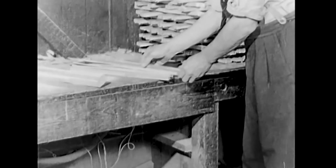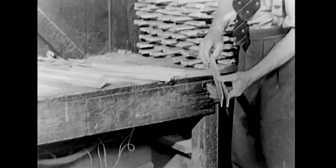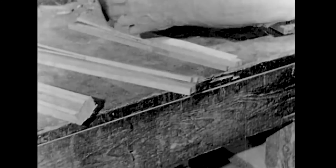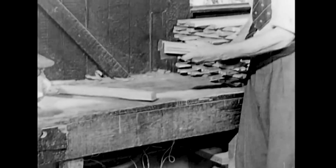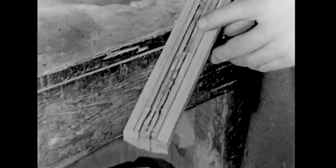The two innermost sections are slit and a length of rubber is inserted. Between two sections, with rubber insets, a spacer and a length of rubber are sandwiched. The fourth slat completes the assembly. The whole is glued together to form a springy handle with rubber inset shock absorbers.